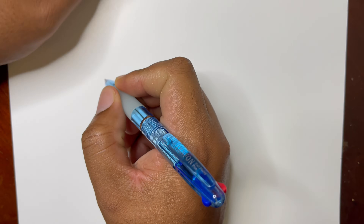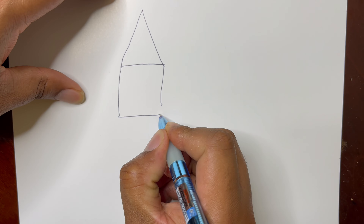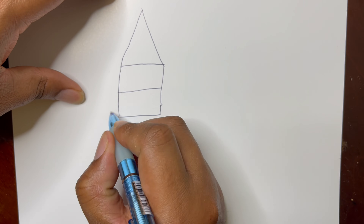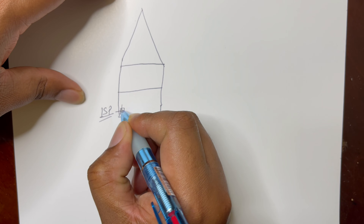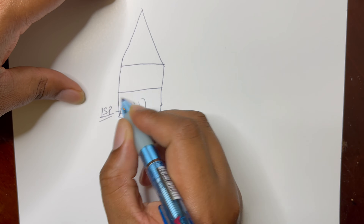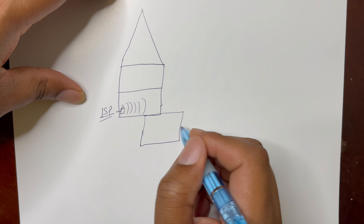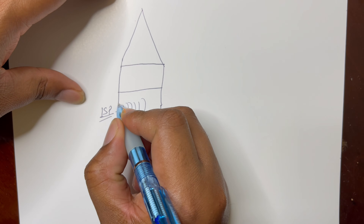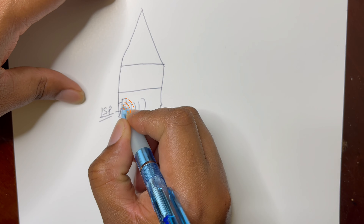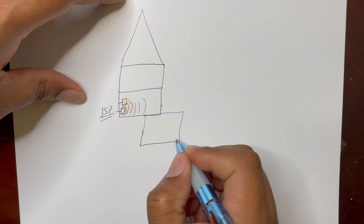We'll be doing an illustration of how the system actually works. If you have a two-floor house, your ISP — your internet service provider — comes in here, and you have your modem placed in an area only covering your ground floor. You have a basement with no coverage at all. What powerline technology does is allow you to place an adapter in your power socket and run a cable from your modem directly to it.